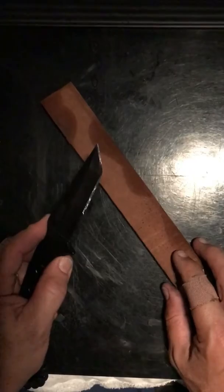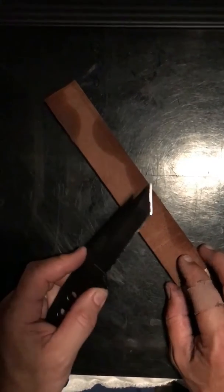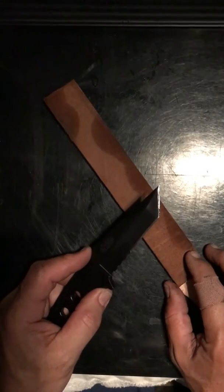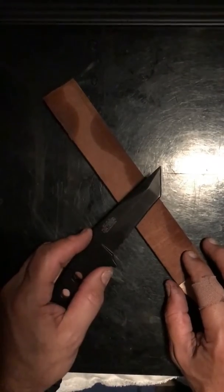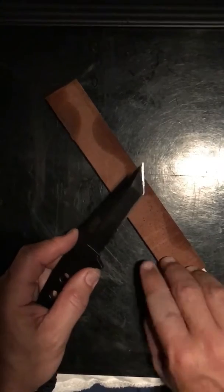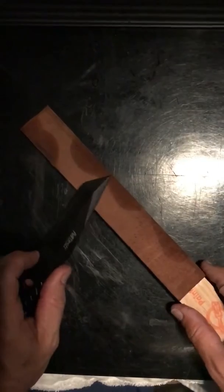What we're doing is we're rubbing off metal cells a few at a time. Well, tens of thousands with each pass, but microscopically we don't notice it. We're just rubbing off cells from one side, rubbing off cells from the other, but we're not actually cutting into that final edge and pushing it this way, which makes a burr. We're just rubbing it off both sides.